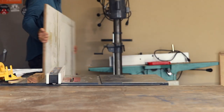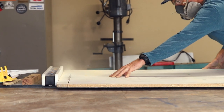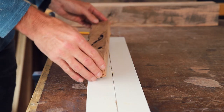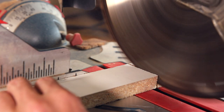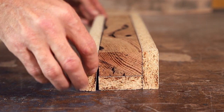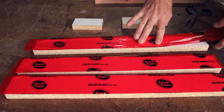This piece of wood will become the handle of the mallet, and due to all the little bug holes and a big void on the back side, I had to build up a form out of melamine. This red tape I'm using is called tuck tape. I used it to cover the form so the epoxy won't stick, and then assemble the form with screws.